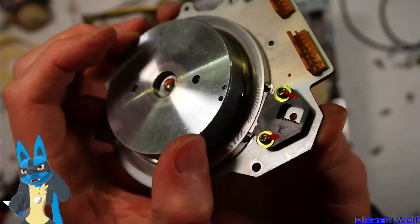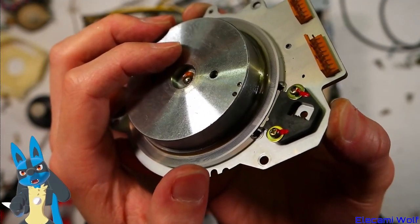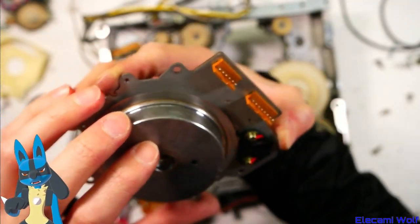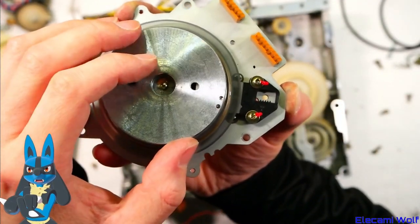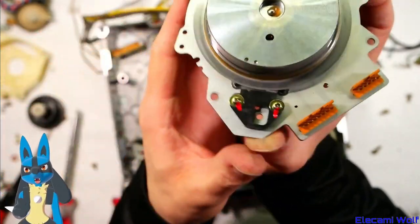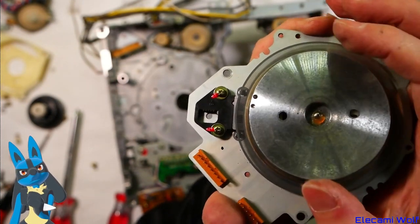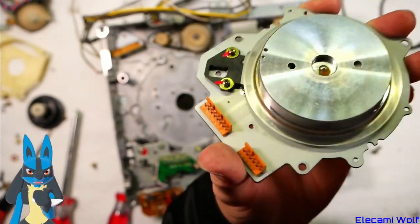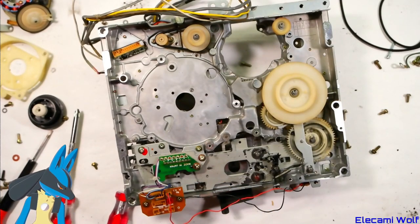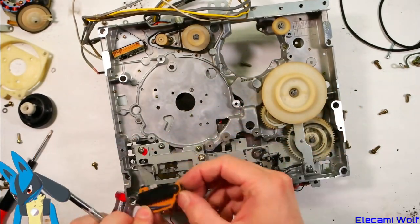There's the grate — or grating — that has a screen on it, and then there'll be two light sensors in there. They appear to be joined in series, which is interesting — maybe it doesn't sense direction, it's just looking at the movement. There's the stator for that and the magnet around there. The grating must work with the screen to make a very fine slit available so it can determine the precise position. You can kind of see it in there — you can see it jumping as it passes and see that opening and closing. So that could work as an incremental encoder because you can see how they open and close alternatively.